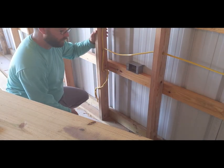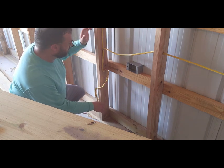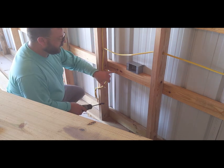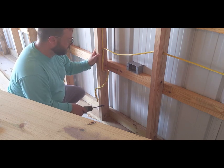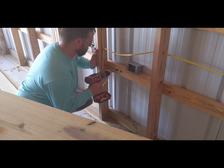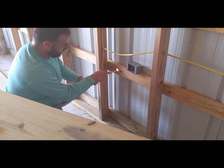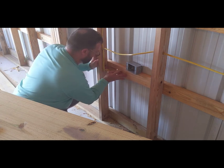Okay, so I've done a little bit of prep before we moved on to the very next outlet, which was perfectly placed because the next one in line is going to be our first outlet on the exterior wall. What I'm going to do is take this auger bit right here in the drill, and using the mark I've already made, drill through the wood and see if I can get through this metal exterior right here. So we're through, and now we can go back and take these pieces of Romex and just fit them right out our beautifully made hole.